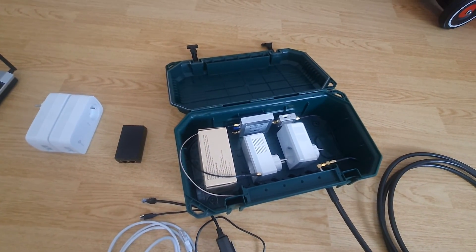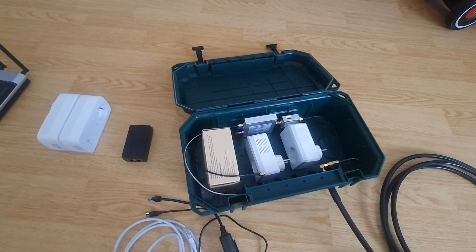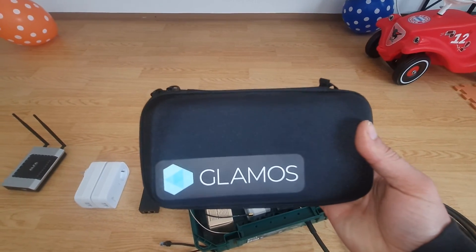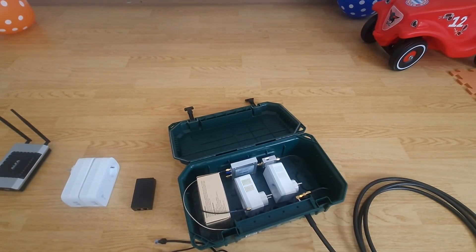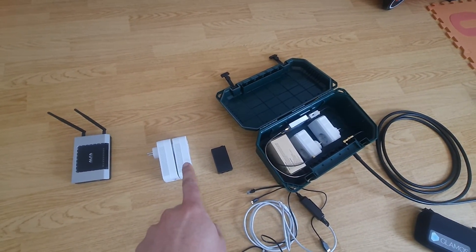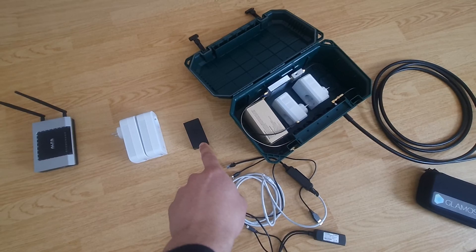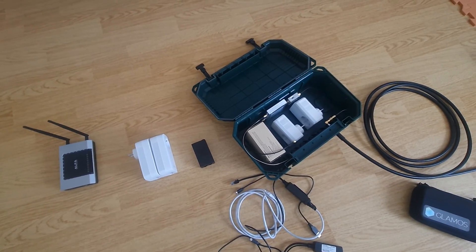I hope you understand. If you have questions let me know, and if you have ideas for future videos let me know — I will make them. I'll also try to make some extra testing videos to show you how to use the Glamos. Quick setup recap: from your router to your powerline, from your powerline at the balcony or window to your PoE injector. If you have one miner use a single PoE injector; for multiple miners you need a PoE switch.